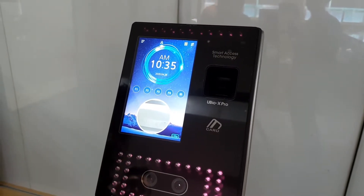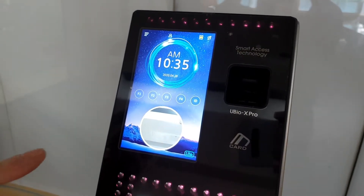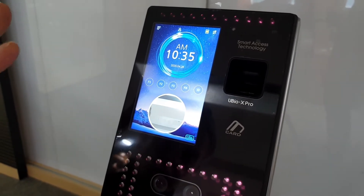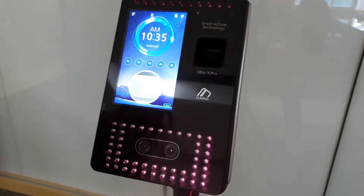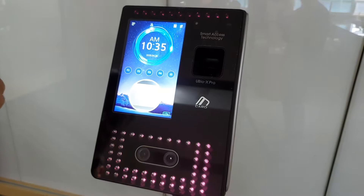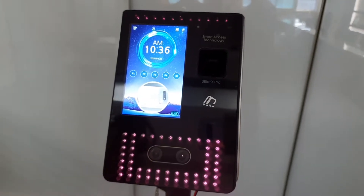This is the demonstration for the U-BioX Pro or ProLight. This device is an IR technology — its main technology focuses on using IR for detection of the face, not mostly visible light. About 10-20% is visible light, but 80-90% is using IR technology. This is important to know because this is why you cannot use user pictures from your phone or pictures already in the database to register the face, since it uses IR LEDs for capturing the face image and extracting the data.